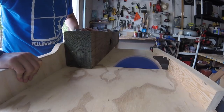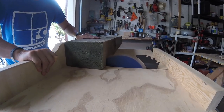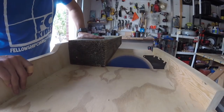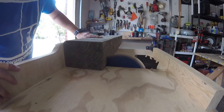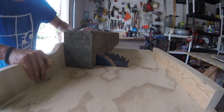Since I didn't want one end to look old and rustic and the other end to look new and freshly cut, I ended up cutting off both ends of each beam, making the final length of each beam about 42 inches. I used my table saw and my miter sled to do all the cutting of the beams, but if you don't have a miter sled you could also use a chop saw and just rotate the beams around, making cuts about halfway through on each side.